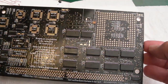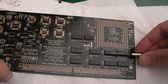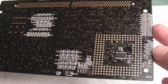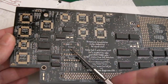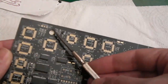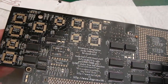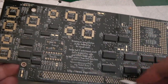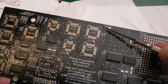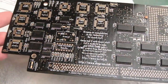But you can see it's really coming on leaps and bounds. Most of the components are actually on there now — it's just the crystal, the delay line, the PLCC stuff, and the connector and jumper. The regulator's not going on — I've bridged the in and out where the regulator goes so that five volts will come onto this. And then the final thing is to stick the electrolytics on here. There are five of those, just like on the A3640. I'm going to tin over these little wires around here before I fit the caps so that if a cap ever leaks it won't affect the wires.